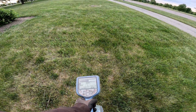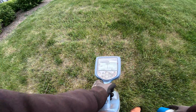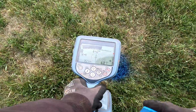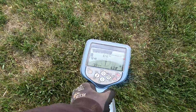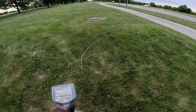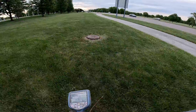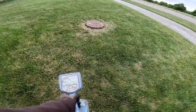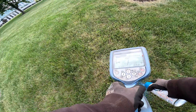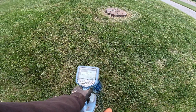I'm getting a pretty decent tone, reading about six feet. Compass is straight. Milliamps don't mean much because you're on cast iron — high resistance. You need it to be on a higher frequency. My compass is tilting; I must be getting onto the center of the valve.